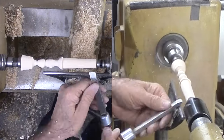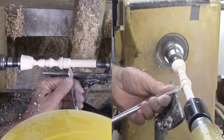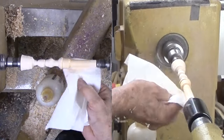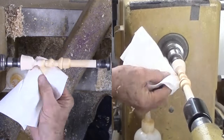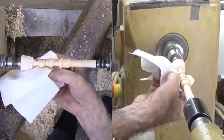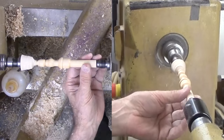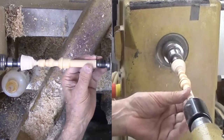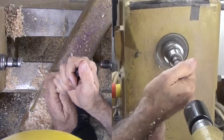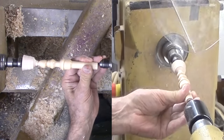The legs are way too thick. Back at the main axis, I reduce the diameter from the thigh down. But just in case, I had better apply finish now before anything is parted off. Focusing on the lower legs, I shift the axis 90 degrees from the previous shift on the live center end. After shaving a little bit, I shift the opposite direction. Then some sanding and shellac.